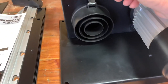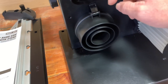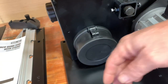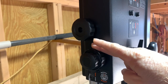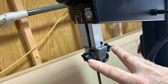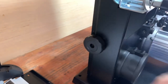Quality motor — three and a half amp, I believe is what it's supposed to be. We got our dust collection chute here, and this is really nice because you got different sizes that you can connect up here. I don't have a dust collection system so I use a shop vac, so this smaller one will do great for that. Front side here we've got a knob to open the door to our upper wheel, this one looks like our raise and lowering knob, adjustments here for tracking on our bearings, and another knob for opening the door. So far I'm liking the quality of this.